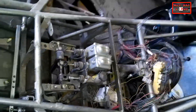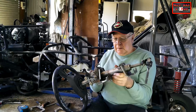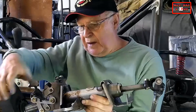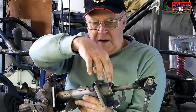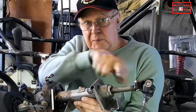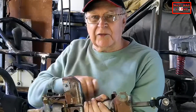I'm going to have to significantly shorten this part of the steering column, without making it so short that I lose stability when I mount it. To be able to shorten it, I've got to take it apart, and to put it back together I need to understand how it functions. I've got the up-and-down swivel section at the top, a bearing there and there, and this long shaft coming out. I'd like to bring that uni-joint back about 150mm, which will still give me enough strength so the steering wheel won't wobble and the shaft will be securely anchored.